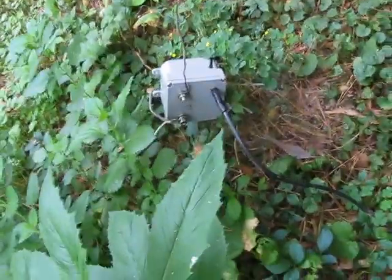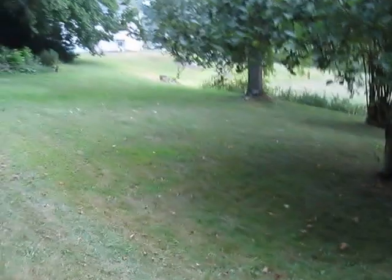Let's give you a quick view of the backyard. Here's an EWE antenna over here. Type 75 transformer and goes up the tree 15 feet. About 10 feet away over here by the tree, I have a common mode choke and a ground rod. That EWE goes over this tree over to the southeast here and there's another transformer box on this tree.